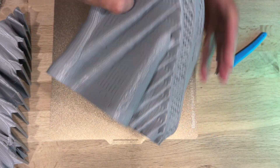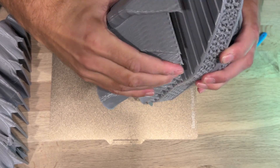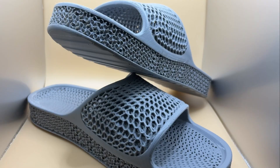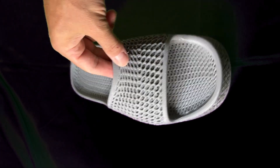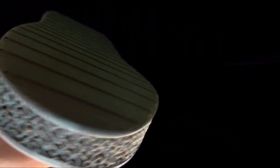What we found out is that TPU 95 is a little bit flexible. For shoes, that is not enough, and our lesson learned for future shoe prints will be to take softer TPU like shore hardness 90A or 85A grades, and that we have to invest in a drying chamber to make it feasible to print. The first shoe we have printed is good to display, but the test to use it was not as successful since it is not flexible enough, so they are not comfortable to wear. It seems there is still a long way to our dream of the future.